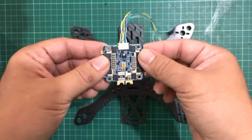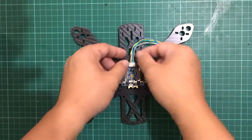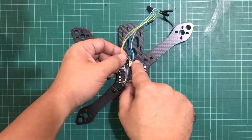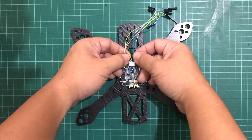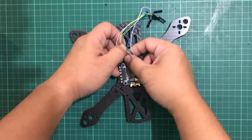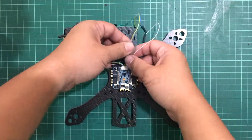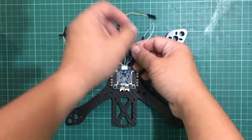Another way, if you really want to mount it a specific direction, the last four wires here are for the motor signal wires — motor one, two, three, and four in sequence from left to right. So let me just take all of those wires. These last four wires are your motor signal wires, and from yellow, this is motor signal wire one, two, three, and four.